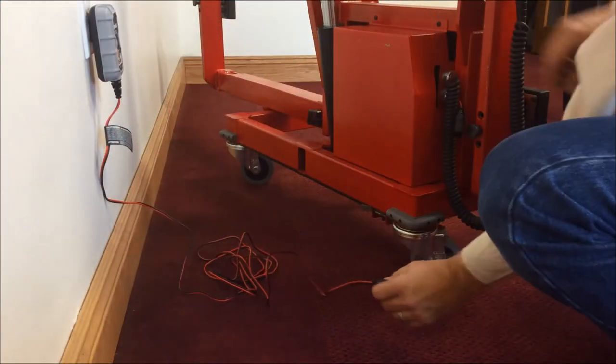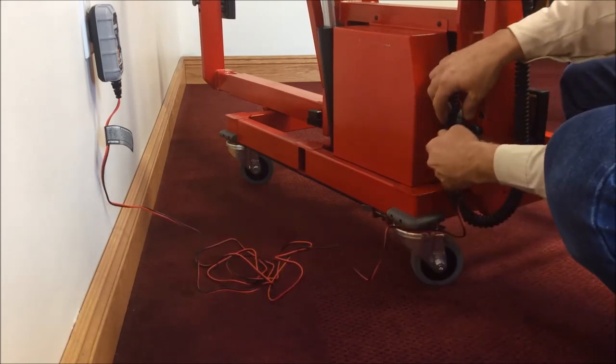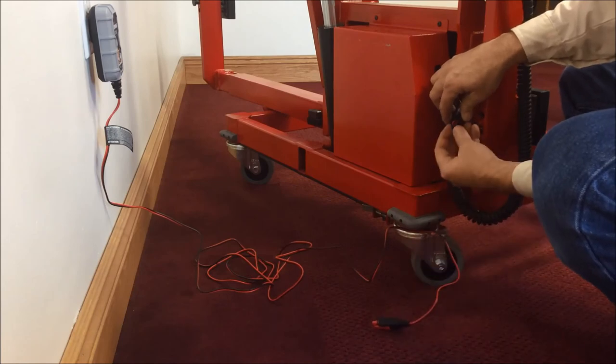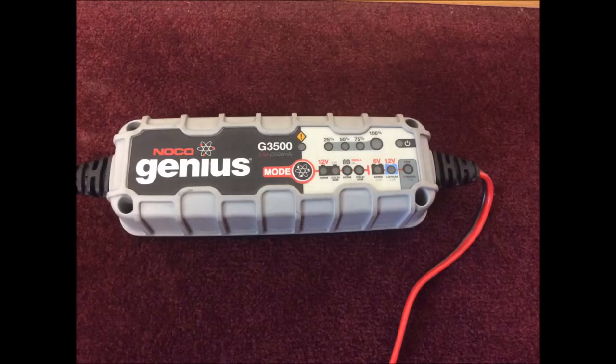You can plan on moving roughly six pianos on one battery charge. Two different battery chargers are available depending on how many pianos you would normally plan to move in a day. Charging could not be simpler. Both chargers are charge maintainers which can remain plugged in without damaging the battery, so your Grand Mover is always ready to go to work. The standard 0.75 amp charger will fully charge a battery overnight or in about 10 hours. A larger optional 3.5 amp charger will fully charge the battery in about two and a half hours. If you need to move pianos continuously all day, additional batteries can also be wired in series.